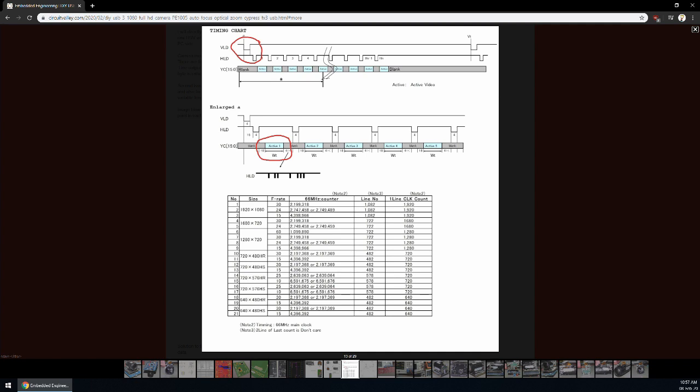Second issue is H-sync does not actually indicate valid line output. First, for the very last and very first line, it remains active for too long, up there on the right side corner. Last line gets transmitted and H-sync does not get deactivated till the very start of next frame. H-sync does not actually indicate active pixels. And there is a fixed offset.